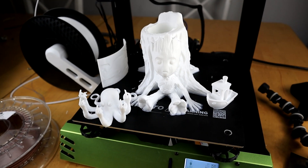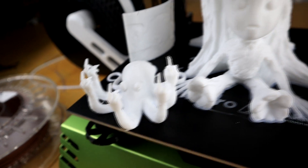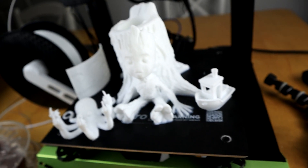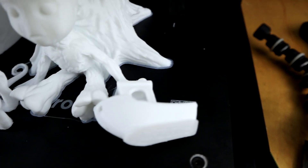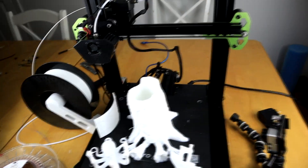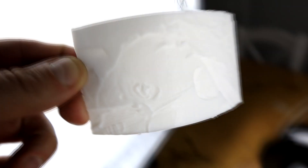I've done quite a few test prints with just this regular PLA. The first thing we did was just a provided G-code and that turned out good. Then I started slicing my own thing. I used just stock Cura settings and this one came out okay, but there was definitely some over-extrusion and some retraction needed to be adjusted. So I fiddled with the retraction and the flow rate, and then I printed this Benchy. The Benchy came out much better, except there are some layer lines. I could tell that was a mechanical issue — my eccentric nuts were tightened too tight, so I just slightly loosened them and everything came out better. Then I printed this lithophane — it just looks plain, but when we hold it up to the light, it's a picture of my nephew. He's only a couple days old.